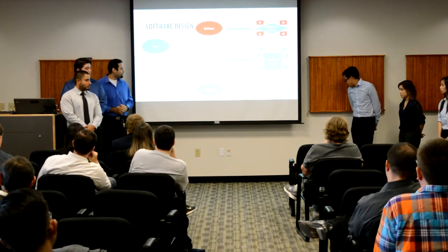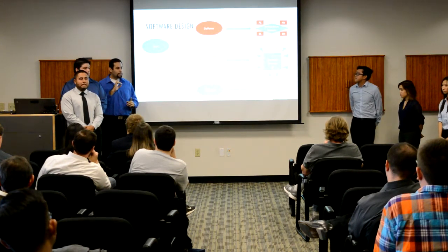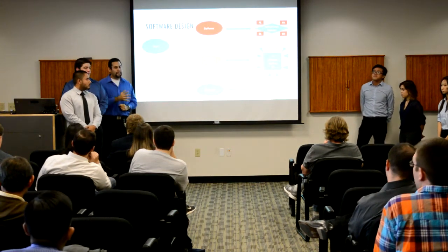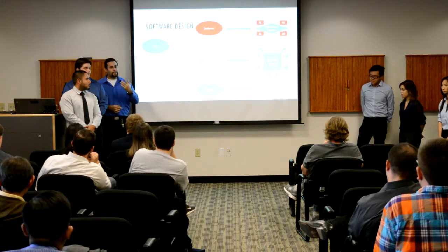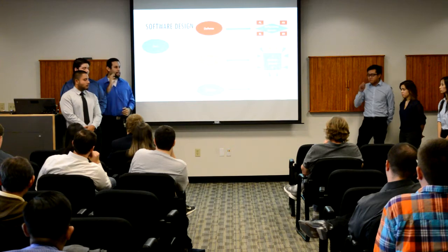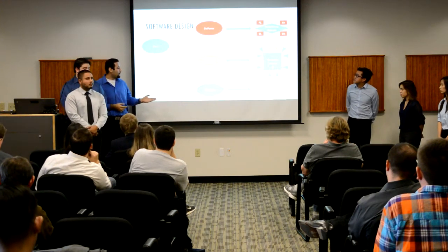In the offense state, depending on which proximity sensor detected the opponent, the robot will turn a certain degree until the front sensors are facing the opponent robot, and it will attack it. It will adjust the duty cycle on the PWM in order to make the motors rotate more and increase the speed.